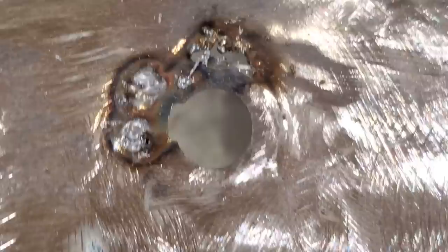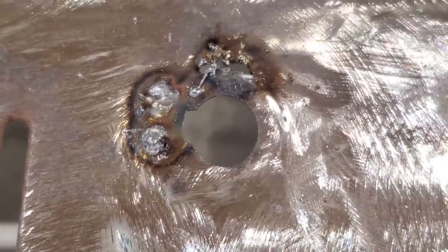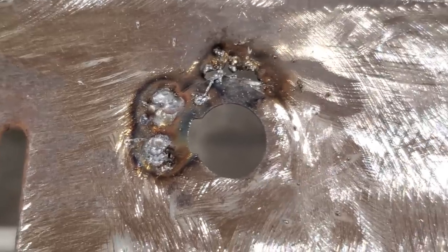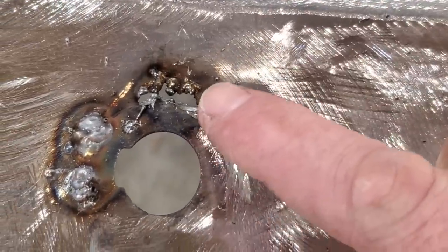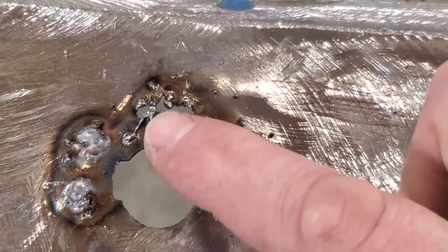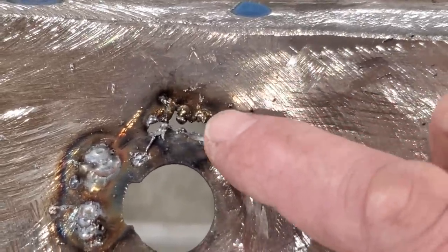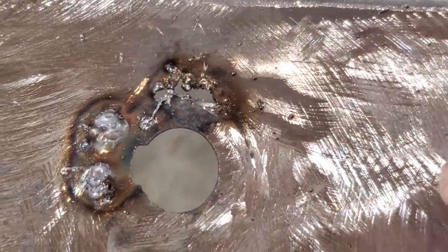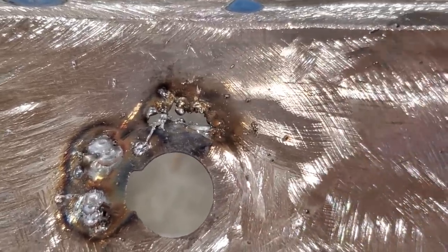Now I'm gonna stop it there. You can see I got it all over here. That come out pretty good that way. You see me pulsating the trigger, slightly clicking the trigger. And all I was doing over there, as you can see right here, is welding around it, trying to get some metal around the low area. By doing so, I'm making the outer edge of it thicker by adding wire to it. And every time I struck it, it'll turn red hot.